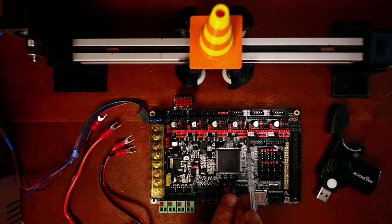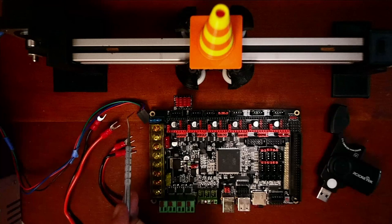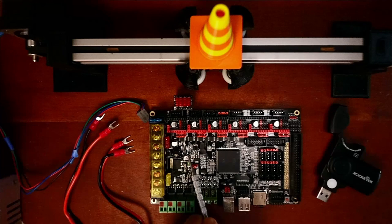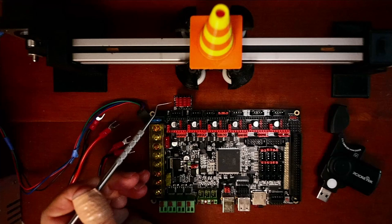Notice there are two ports for the Z stepper. These are actually jumped at the moment, but if you were to use a second NEMA connection, you would remove these. The board does come in an SPI configuration, which is how the TMC 5160 Pro operates.